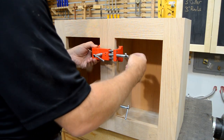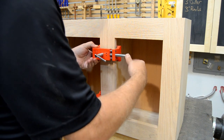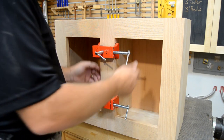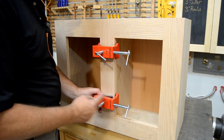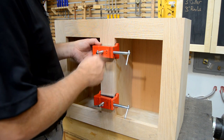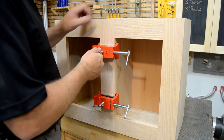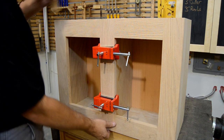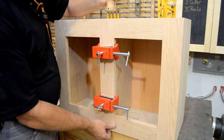These clamps are simple and effective. Engage the legs of the side jaws against the back of the face frames and tighten the side jaws, drawing the two cabinets together. Before final tightening, the center pressure plate is used to align the cabinets face to face. This is also the time to align the cabinets top to bottom.